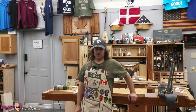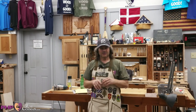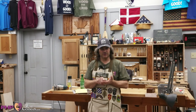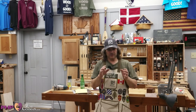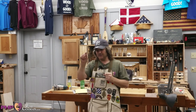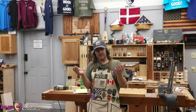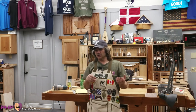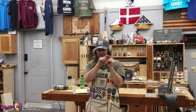So you want enough pressure. Jake said it first. You want even squeeze-out. So then the question is, how much glue should I apply? It's like the healthy way to butter your bread. You want it covered, but you don't want it thick. And when you put your two pieces together and you get a bunch of little fine squeeze-out beads, that's right on the money. If you don't get any squeeze-out, then you may not have had enough pressure, you may not have had enough glue, or you may have waited too long and it started to skin over. But the perfect glue joint has just really fine little beads of squeeze-out all along its length. Good question. Really good question.